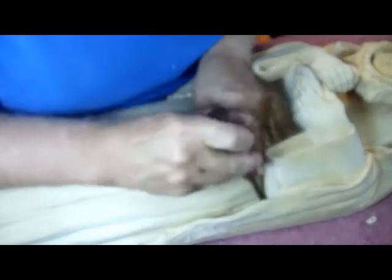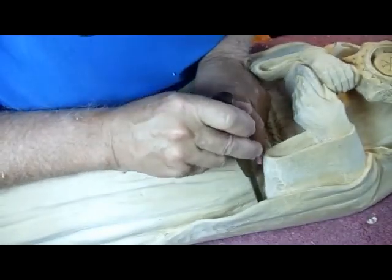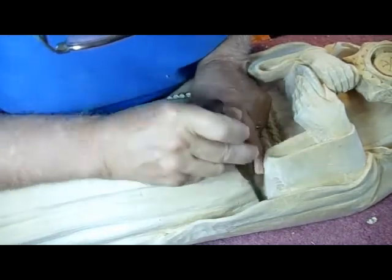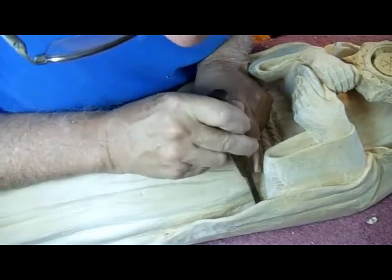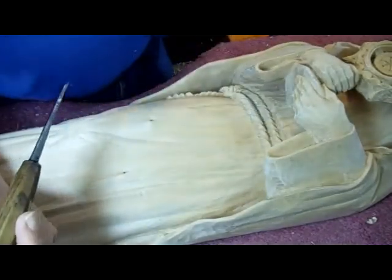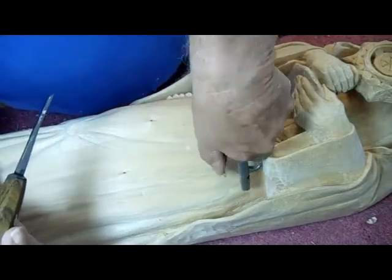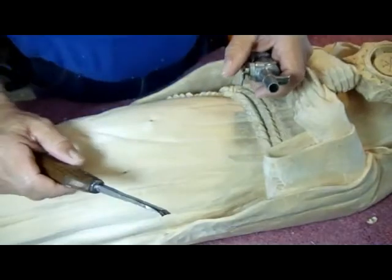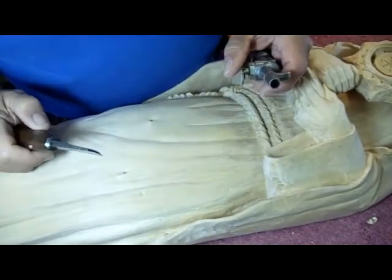After I put the stain on, the stain has got a sealer in it, and just like the wood conditioner has a little sealer in it also, and those raise the grain. So I will be needing to sand, because that raised grain needs to be knocked down. That sanding I'll be doing with like a 400 emery.